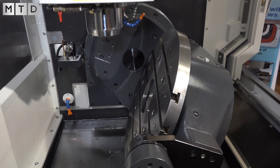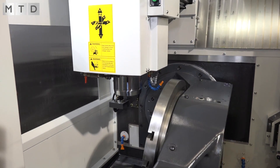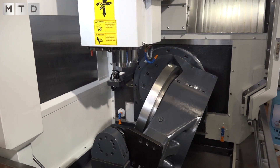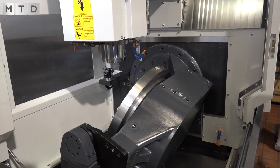There are also options on the tool changer — this particular model has 40 tools I believe. Yeah, 40 is standard and 60 is an option on the tool changer. That can be CAT 40, BT40, or even HSK — it's up to the customer to decide.